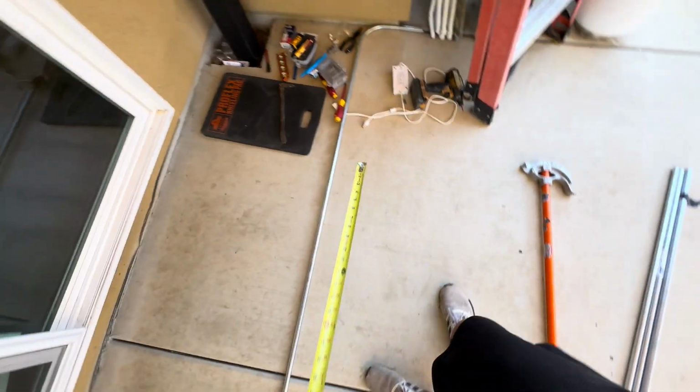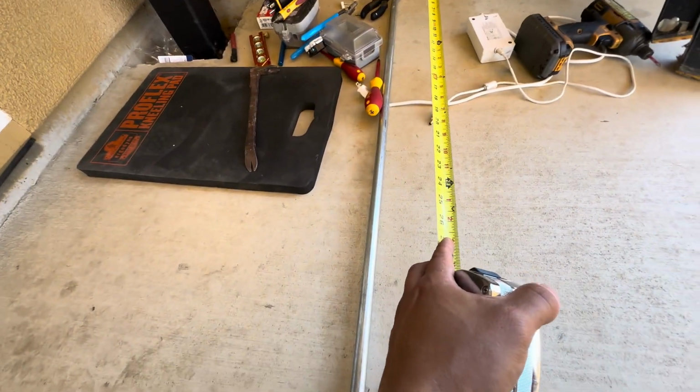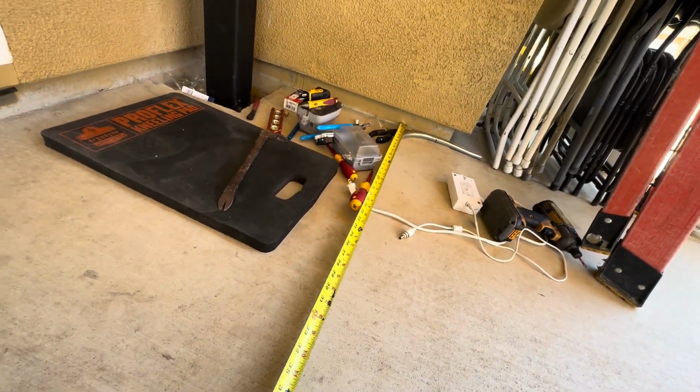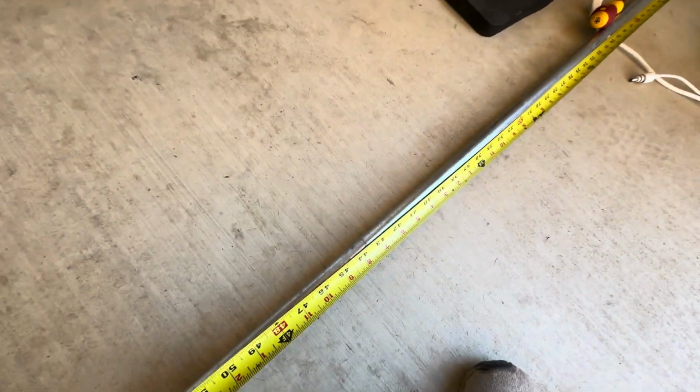So for you to cut it, you want to put your 90 on a straight wall. You could also use the bender, line it up right there. So you put it back there, and basically all you've got to do is go to the wall now, right? Since you've got the 90, it's not going to let you. So just go all the way down to the wall, and whatever you want to cut, that's what you mark.